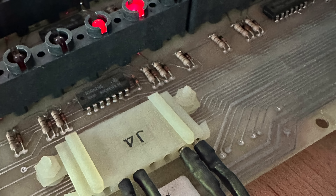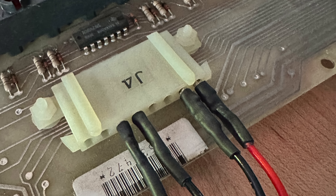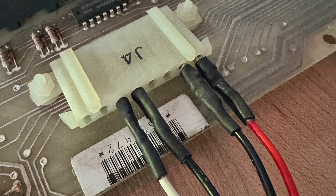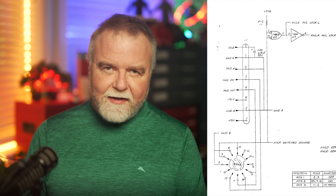I made all the required power connections first, or so I thought. The board has a 5V input but also has that PC power supply connector. I wrongly assumed that was just a convenience and the BeagleBone would power up with just the 5V supply, but it turns out there's a 3.3V side as well. I was able to get things running manually by supplying 3.3V at the right terminal using my benchtop power supply. If you've ever manually powered up a PC power supply, you know there are a couple of pins you need to short. The way Jörg has this designed, you can use the key switch in line with the power supply trigger and it should be automatic. My problem was that the key lock pins are different on my panels than they are in the 1170 technical drawing I found — if you know why, please let me know in the comments. But with the key switch connected to the right terminals, things powered right on up.